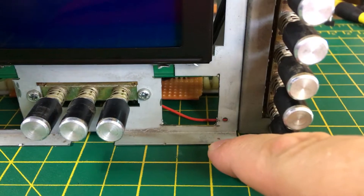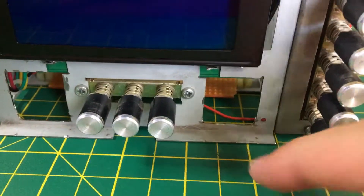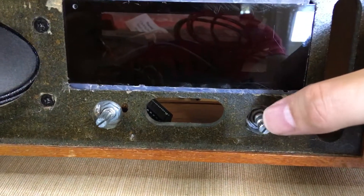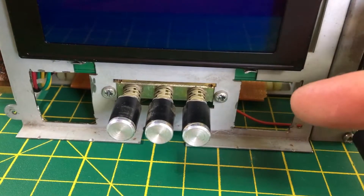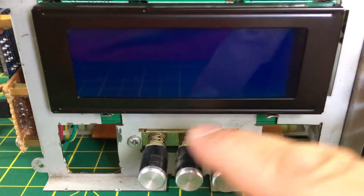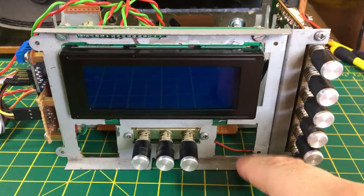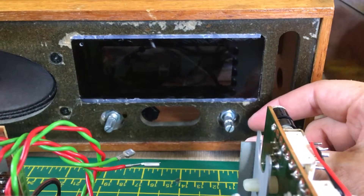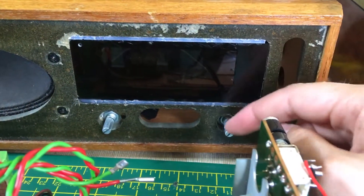To save space — you lose about five millimeters in the frame alone before you even get to the thickness of the wood cutout — the only solution I could come up with was to put a piece of aluminium at the back of the wooden case and mount the potentiometers and rotary encoder on that side, then cut holes out where they would go so the frame would still fit flush and the buttons would all come out the case nicely. It's a bit of a hacky solution, but I couldn't find ones with shafts long enough, so that's what I went with.